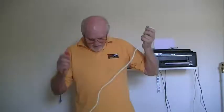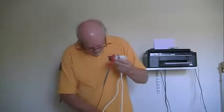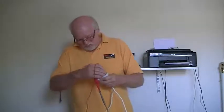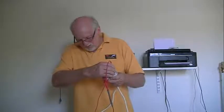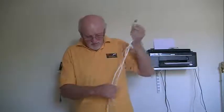Let's go back and do it again. Connect your probe to the earth wire, take your probe and connect it to the earth, and there I'm reading 1.1 ohm. The maximum I can have is 1 ohm, but remember there's a 0.6 error, so I'm getting about 0.4 to 0.5, which is fine.